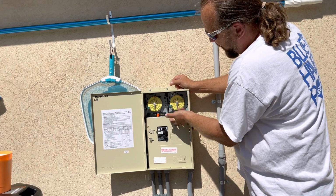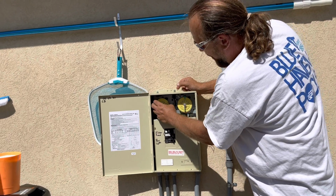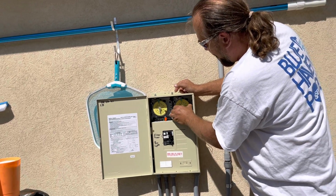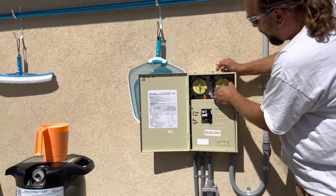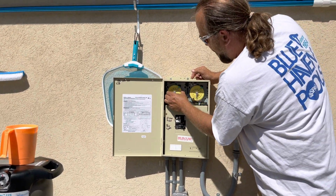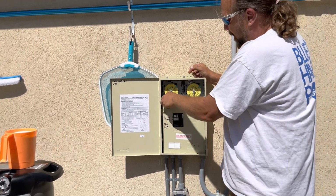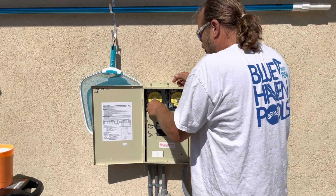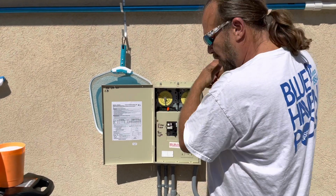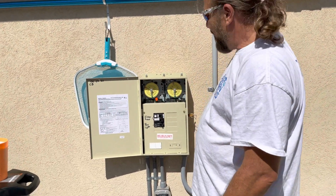This doesn't move, okay? So as this goes around, and your little off guy gets right there, and we're at 8 p.m. We're at 8 p.m. and 8 p.m., and your system is on. All right, now this is going to go by, and bonk, turn it off. And this is going to keep going. Then at midnight, it turned itself off. Then as it went around, at 8 in the morning, oops, back on there. So as it came around, they were both at 8 in the morning, and it's just moving like a clock. And when that went past that little tripper right there, turned it on. Okay, that's how they work.